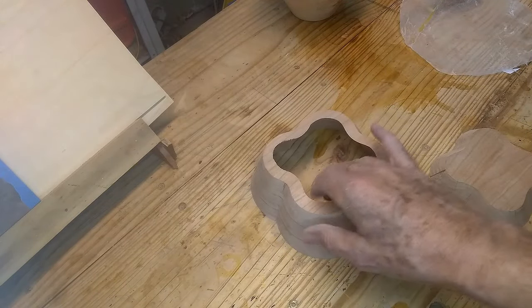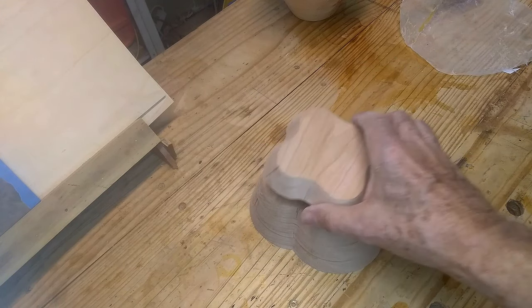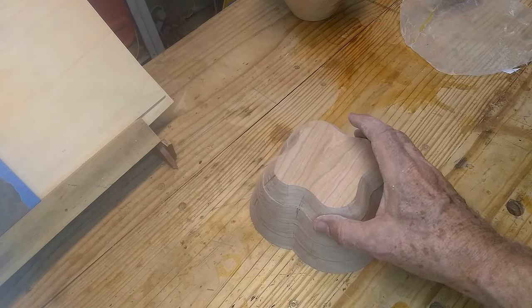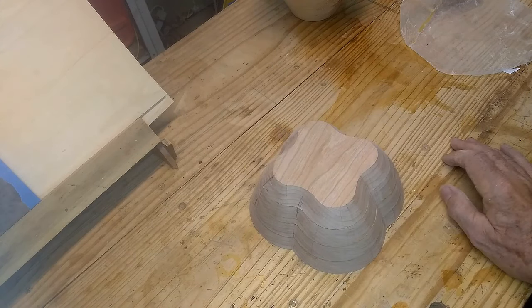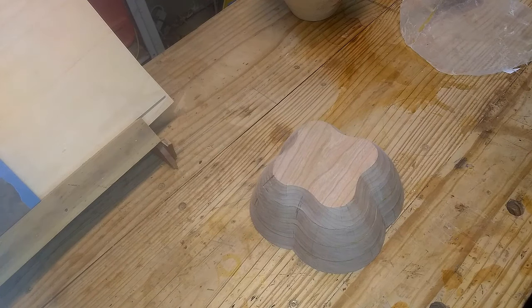And then I'll get my little 2-inch flexible pad sander, and we'll sand the outside of the bowl. And that's a little different animal than that inflatable. I like that inflatable sander, but it takes a little practice and use to really get the feel of it. You can see the little sleeve wants to slide off of it. You can't inflate it too much. It won't be flexible enough.